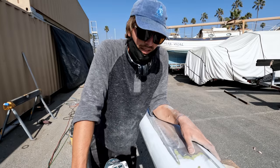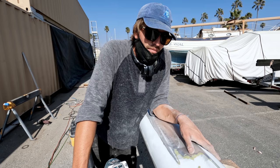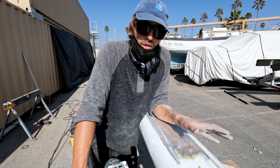We are not painting the mast. We decided that aluminum finish is the more durable solution. It's gonna make us not have issues with crevice corrosion getting underneath the paint and wreaking harm, like it has for the last probably 20 years.